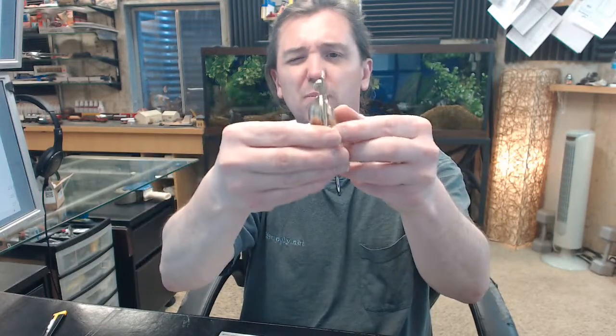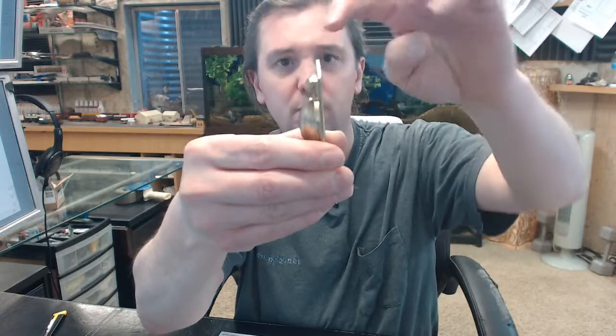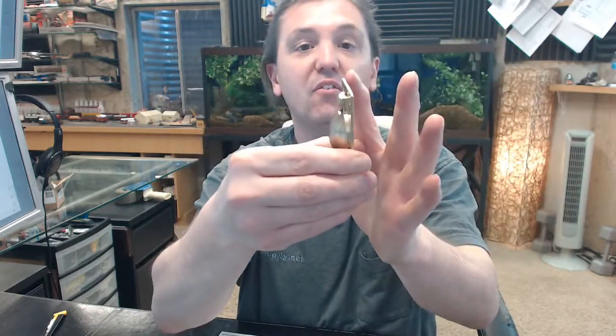Now, one thing that I like a lot about Baldwin hardware, it's all but imperceptible, and certainly imperceptible if you're a homeowner generally, but if you're a woodworker or an installer, you'll notice that, certainly on the back end of this pole, that angle is not a 90-degree angle. The top of the piece of hardware and the face is ever so slightly beveled in, meaning that when you mortise for this item and fit it into the opening, it makes for an incredibly thin, very tight margin all the way around the pole, making the installation look very, very good.